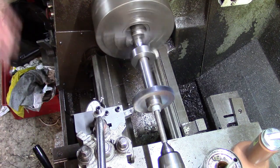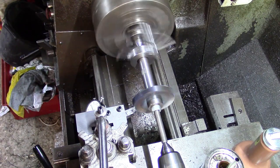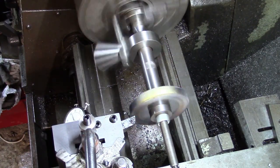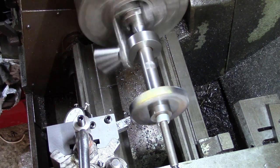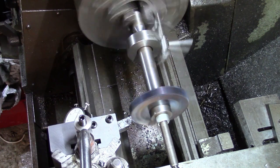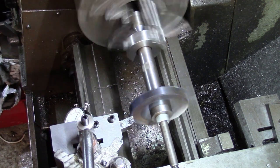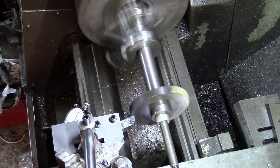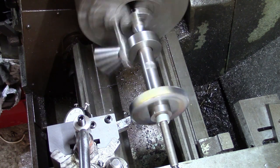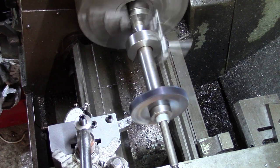Now it's already looking like it's out of round, because that catches your eye, and also the lump of braze as well. According to that, we'll not be far off when that one's taking a little tickle. About another 10 thou left to go. I just hope he's got enough braze on it. It's going to look right. Right, that's back to our zero. But I did come back a couple of thou, didn't I?